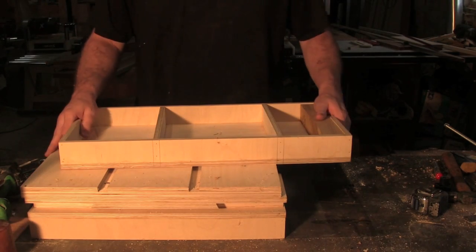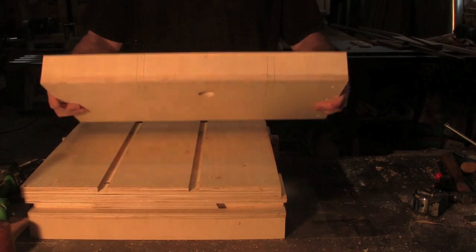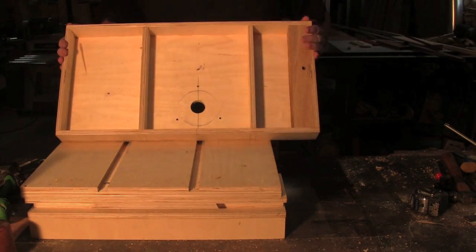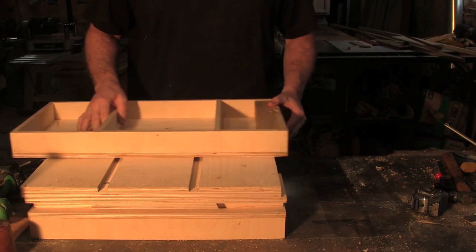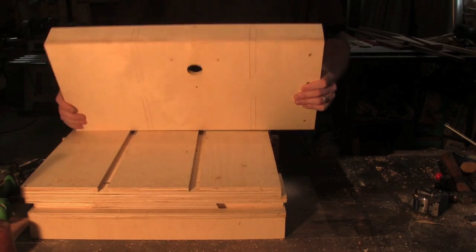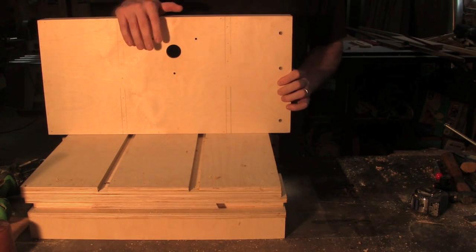Now it's time for the pivoting fence. I made it smaller than the old one. I knew that a lot of the problems I had with rigidity was that the fence was too high. So this one, the dimensions are 24 inches by 12 inches. To make it more rigid, I put some plywood ribs on the back. On the old one, I only had a three-quarter-inch piece of wood attached to a half-inch of MDF for the fence, and that was giving me a lot of flex. So this time I stuck a chunk of two-inch white oak in here to reinforce it, which should take away a lot of the flex.